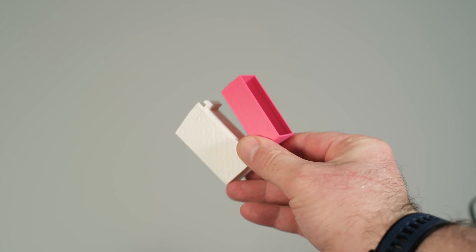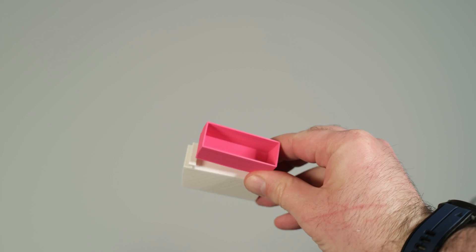The only way I was going to make any of this work is it's got to be smaller in every way. So I do what I've always done: what's the minimum? Let's just basically skin around it. This is how I've worked at almost every company when I've had to deal with plastics — just wrap the minimum amount of plastic around things. It doesn't make it look great, but maybe we can work on that later. What I came up with looked better, though it's still longer than I want. I'd love to go for something in the vicinity of a battery for a mirrorless camera or the SRAM AXS system — something small.